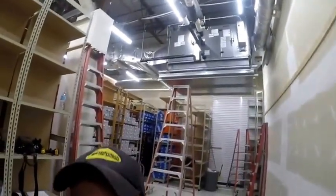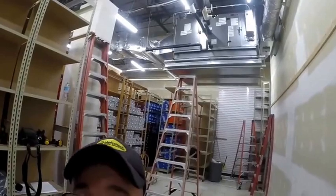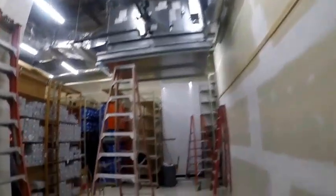I'm going to do another training video this week on chilled water air handling units - got one here above my shoulder. We just installed this unit this week in a Foot Locker store. We're going to take this opportunity to do a training video on chilled water changeovers, how to drain coils if they need to be done. This unit is not glycol.